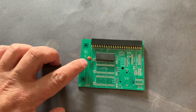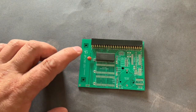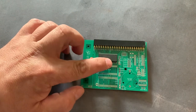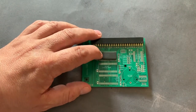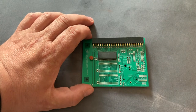A kind of disappointment: none of the memory cards work, so clearly I did something wrong and I just have to figure out what. I found a couple of 100 nanofarad ceramic capacitors, however that did not make this work either. I think there is something wrong with the soldering — maybe some of the pads are not sufficiently soldered to the chip — so I'll try another technique now.